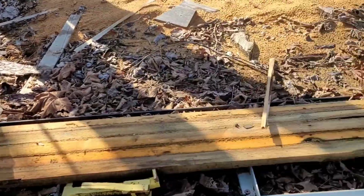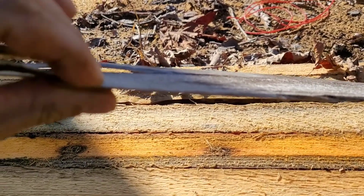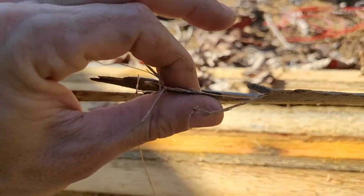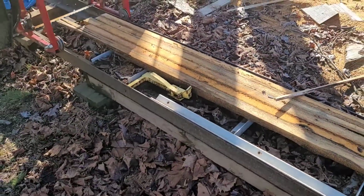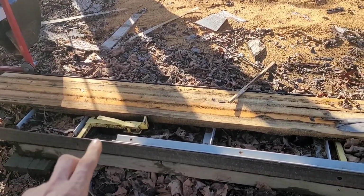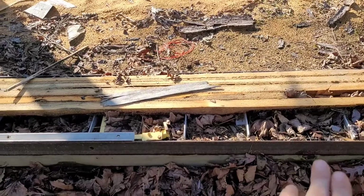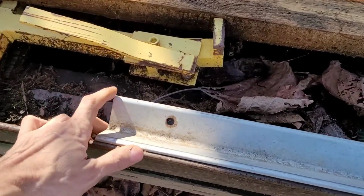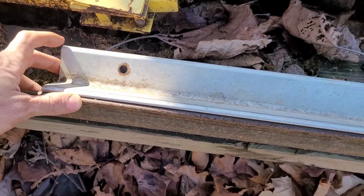And also I want to show you, it's an old piece, but with a good blade, this thing can cut really thin. You can cut 16th-inch pieces off, just veneer. Almost paper thin. And especially with this new track system, it's smooth all the way. Because normally, when it crosses a different section, it would be a bump. And when you back it out, same thing. Some of the track pieces even had, where the transition was, the aluminum worn down, so it made the bump even worse.